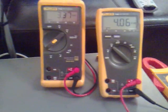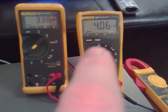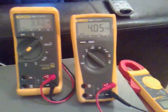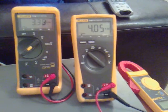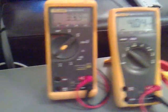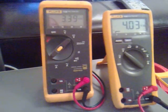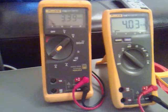I've just rotated the batteries. Getting this to spin up. The battery powering it is at 4.05 and previously it was at 4.15. So we've got a slight volt drop, and the charging battery which was at 2.97-2.98 is now charging at 3.39.